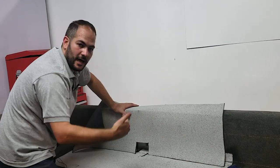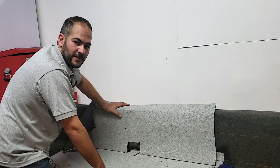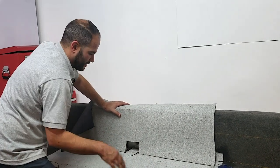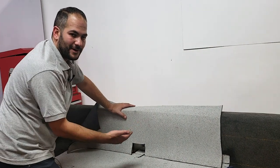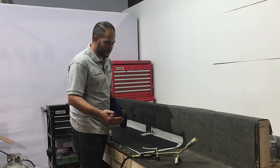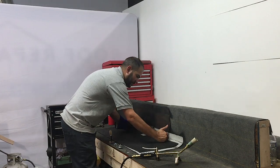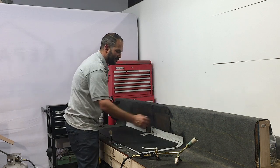So you can really see how this is a multi-level approach. We've got a few different things that we're using for waterproofing. So even if the primary waterproofing fails, we've got secondary and third layers of waterproofing. So we're going to be installing the last layer of torch down roofing that's going to be going from the corner of the parapet wall on the roof up and over, covering our final layer of flashing and smooth.